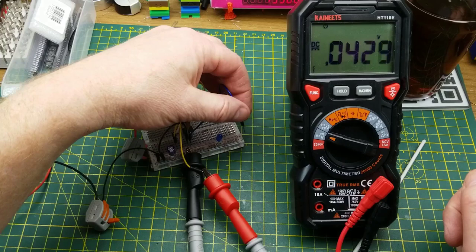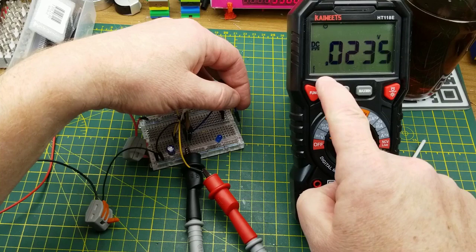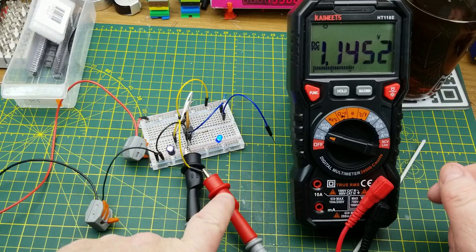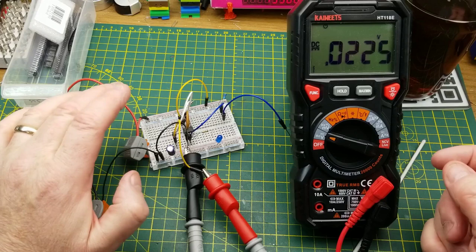So this might be a little bit hard to see on a digital multimeter, but I'm monitoring the voltage across that timing capacitor. So when I trigger this, it should start rising from zero, or essentially zero, up to that 2/3 VCC, and then sharply snap off again as the discharge transistor happens. There we go, we can see it coming up. Yeah, it's changing ranges and stuff, but it went up to about 3 and a bit volts, and VCC on this circuit is 5 volts at the moment, so that's about what you would expect it to do.